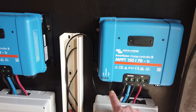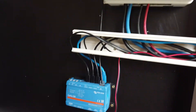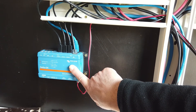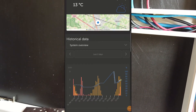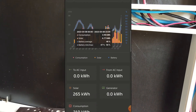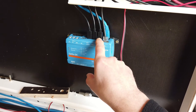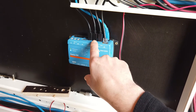There's a black cable below the charge controller going to the Cerbo. The Cerbo collects all the data from your system — it knows the state of charge of the battery and how much current and energy is going in. All data is reported to the VRM portal of Victron, where you can check and change settings from your phone even if you're not around. If you have 4G you can change settings remotely — that's a real added value. We have two cables from the smart solar controller, plus a third from the Victron shunt. All three VE Direct ports are used.